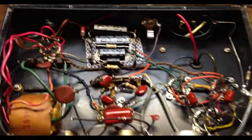Right now the bass and treble are more or less straight up, and the volume is a little bit past halfway. We also have a pad on the input here, this little switch. Again, you saw where I wired that up so that it's attenuated at different levels. And right now I have it set on the 100K. We'll try it on the 60 or on the 47K also.